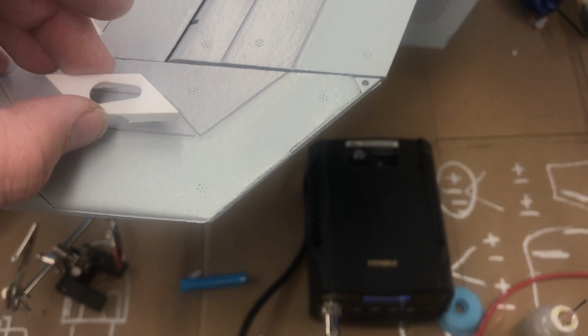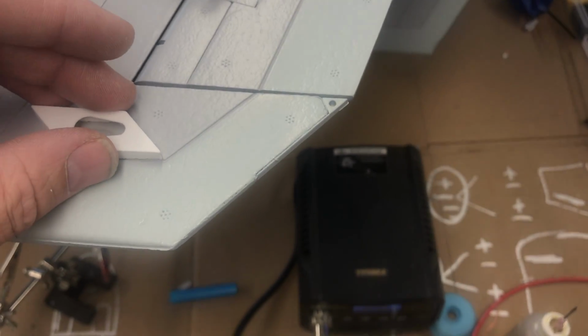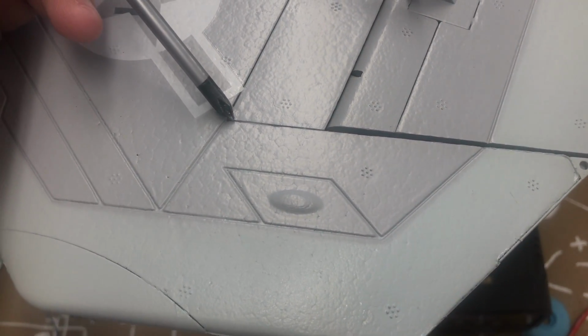All you're going to do is, after you've done your lenses, you'll slide in the top. That's what I would do first, is the top. You slide it in first and you glue it into place. Okay, so it'll be the opposite way. You slide it, you glue it into place, and then from the bottom, because your wires are going to be getting routed, you're going to need to make a wire channel that goes from here right up to there.